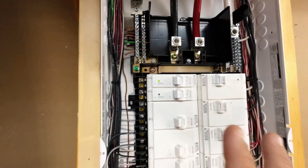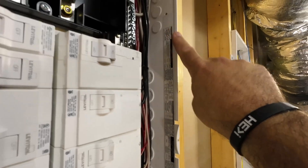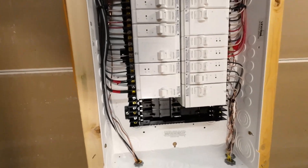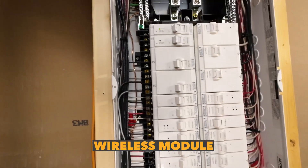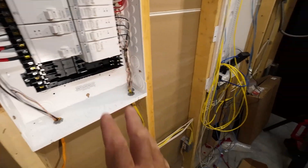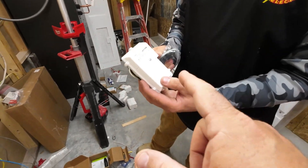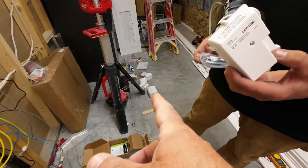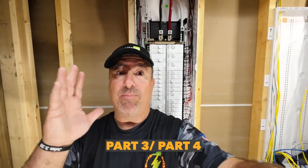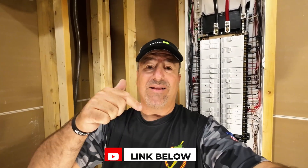We're boxed up and torqued. For torque ratings on these panels, look at the labels — that's how you're going to torque it up. Thank you Steve Cavallaris for telling us about the code on that. We have the wireless module here — they're going to get a module that bolts right onto the panel, but they sent us the wired version, which gets wired into a separate breaker. I won't be doing a review video on that quite yet because it's going to take me some time to set up the app, but I will do a follow-up video. Or click the link below — you'll go straight to Leviton's website and they'll tell you everything you need to know.